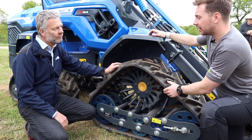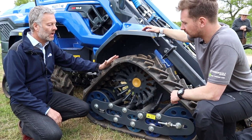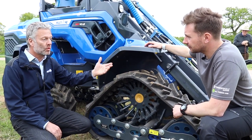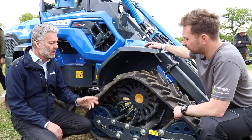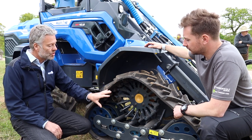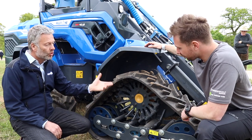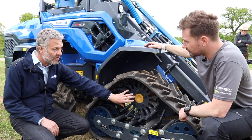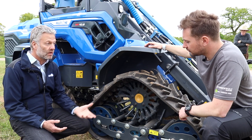So these are, I believe, in addition to the standard wheels — these tracks. What can you tell us about these? Well, tracks is a new thing for us. We've just basically launched the track system. This is retrofittable — you would take the machine as standard with wheels. You can buy the machine as a track machine from the outset, or you can start with wheels and we can add the tracks at a later point. We can switch between wheels and tracks, so they're transferable. The track unit's British engineering — it's actually a British design and we do those here in the UK. All authorised and supported by the factory. The track system itself is supported and carried by the chassis of the machine, not by the drive motor. The drive motor just propels, so you get less load on the components of the machine on tracks than you would on wheels.